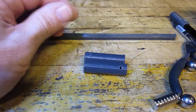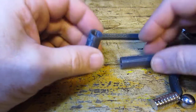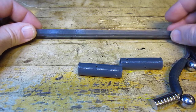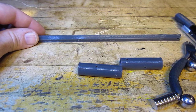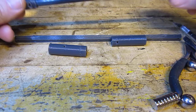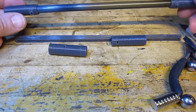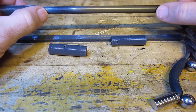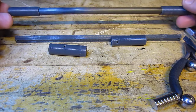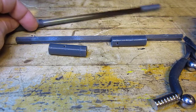I'm going to show you how to put together the magnetic arms for the Rostock Max. This version of the arms is an all-printed version — the rod that goes in the middle between the two connectors is printed. Here's a version I did with carbon fiber as the rod, but I couldn't get it quite the right length just cutting it, so I tried a different way by printing it, and it turned out pretty good.